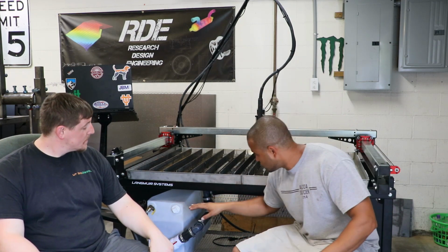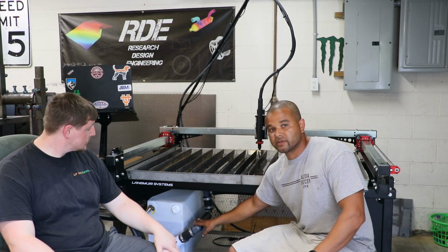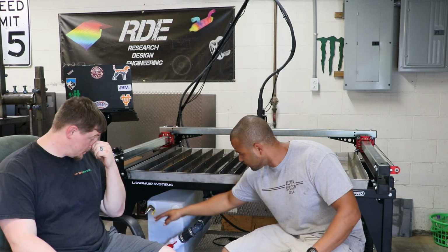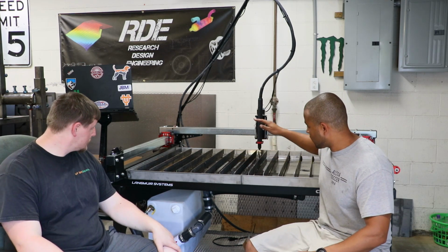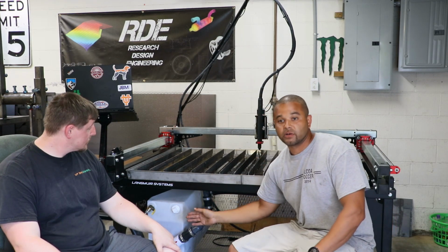It features a 16-gallon tank, and this is a closed loop system. So what we can do is we can easily put in compressed air right here, blow the water up, if you will, and fill the table. And then once we get it filled and used and ready to drain it back down, we'll just open a valve and it goes back in. And it works very well.